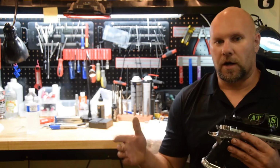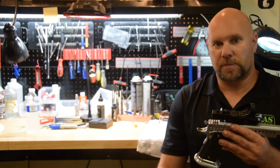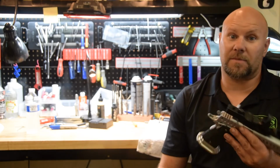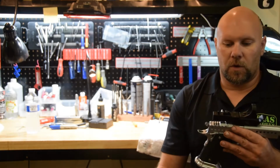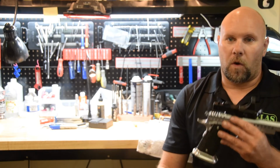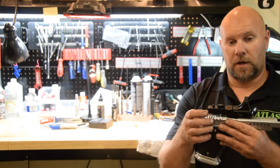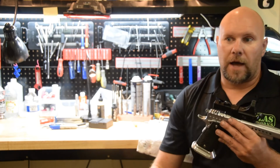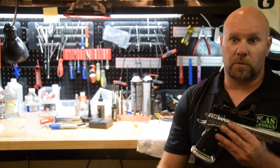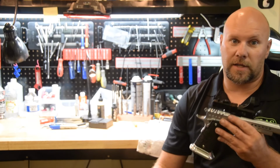In all three guns, the most important thing is the barrel fit. If the barrel fit's really bad, you're going to spend so much money fixing the gun that it doesn't matter how good your deal was. So make sure that the barrel fit was done well. A lot of times, the tolerance stacking between the slide, the barrel, and the frame will have some gun builders who build lots of good guns get a bad tolerance stack on those three things, and they have a bad barrel fit.